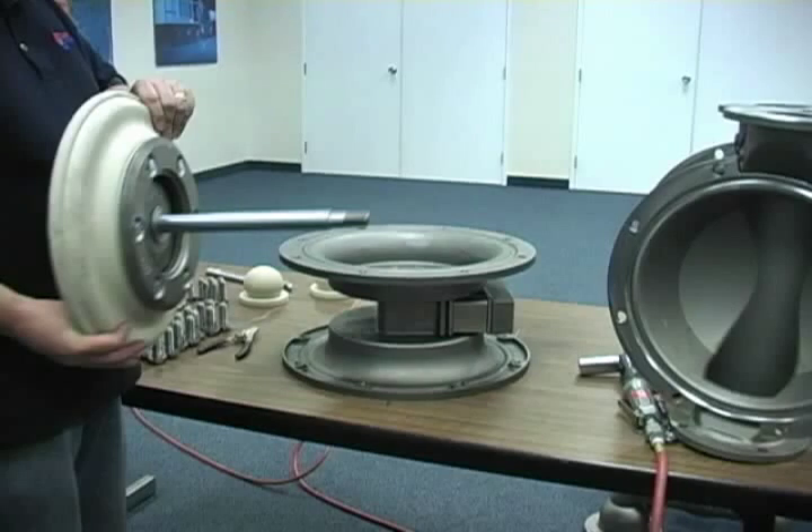Next, build a shaft, piston, and diaphragm assembly. The shouldered washer must be installed with the shouldered side towards the center block and the flat side towards the outer piston.